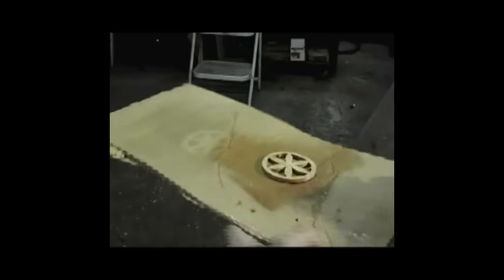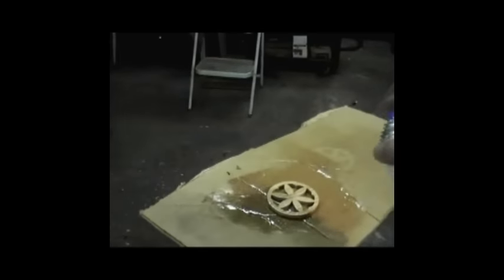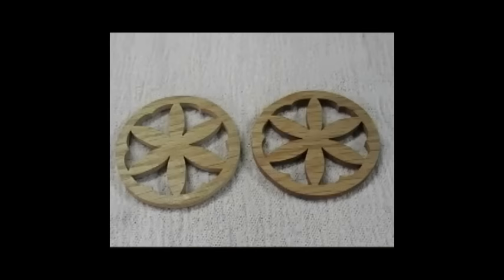You should actually let the linseed dry for a little bit longer, but for the purposes of this demonstration, we'll go ahead and seal it using low angles to get the sealer into the inside cuts. The dip piece has a deep, rich look with a raised grain yet still retains its natural color. Since the oil has penetrated the pores, it also requires less sealer. When working with hardwoods, I always try to keep them in their natural colors and dip the pieces using this process.